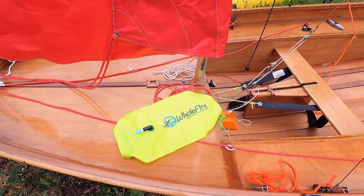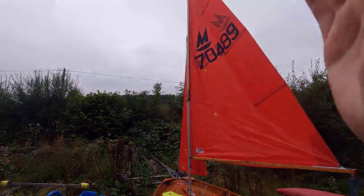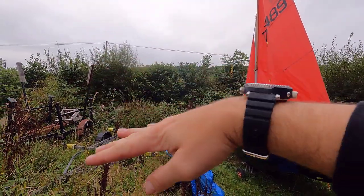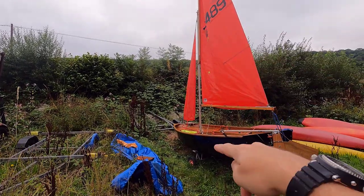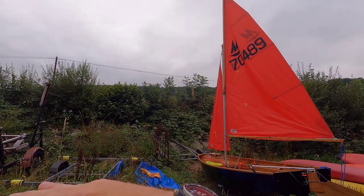Last time I sailed and was capsizing, I noticed some lasers down at the sailing club by the campus site and they all had these little bags at the top of their masts. I've since found out you can use a buoyancy aid for swimming or get specific mast bags. What these do is as your boat goes over and capsizes — mine was going right over and turtling, so the mast was right 180 degrees to where it should be — this bag of air, attached to the top of the gaff, should stop the mast from doing that. We're going to give it a test maybe at the end of sailing today.